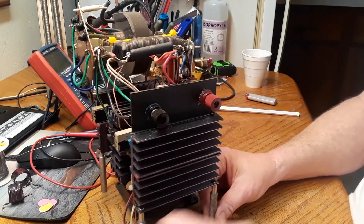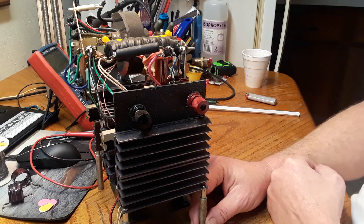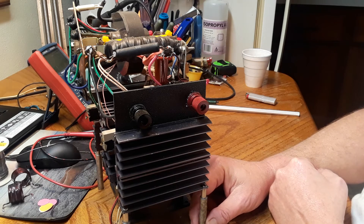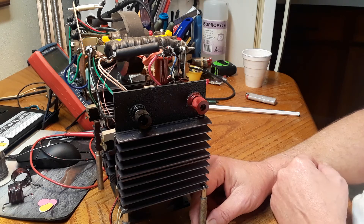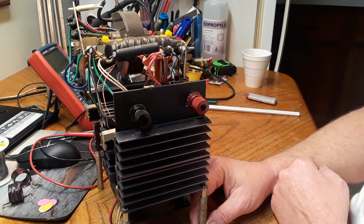This has dual primary windings of number 16 litz wire — it's five turns to the center tap, and five turns from the end tap to the center tap on each side, so it's 10 turns center tapped on the primary. The base drive windings are four turns center tapped, and it has dual windings — two primaries and two base drive sets.